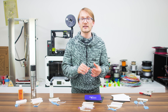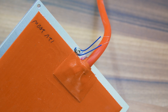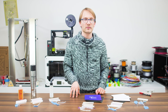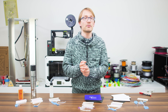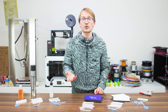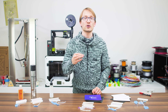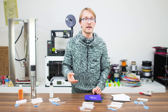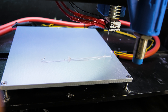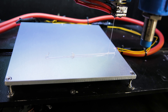Since the PEI-coated bed for me is the entire bed setup minus the undercarriage, he also included a beefy 200W silicone heater for this 16cm bed. The PEI works amazingly well as long as it's heated — it's completely useless when cold and won't even print PLA at all, but once it gets the temperature bump, it works beautifully with ABS and PLA and had the prints sitting completely loose once cooled down. And while PET is supposed to work with a heated PEI platform, I couldn't get it to stick at all.